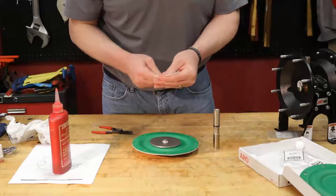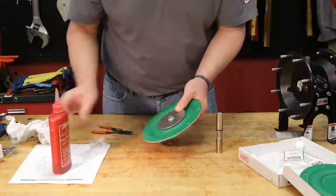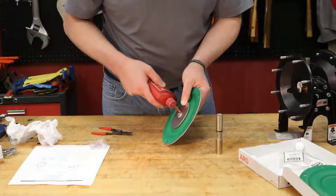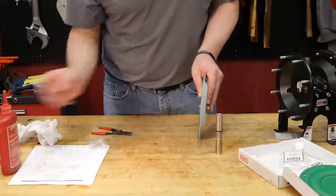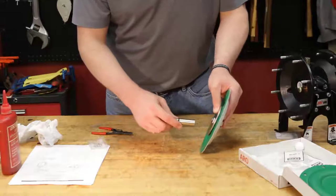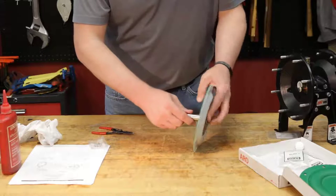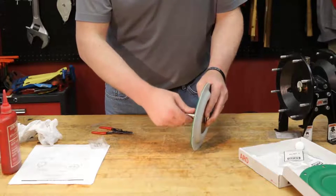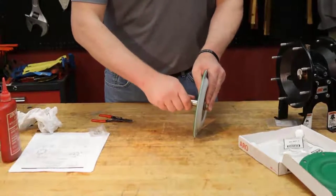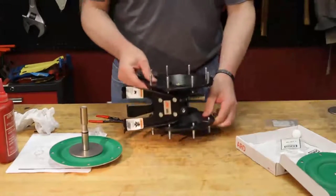And we can put that on in a moment here. Take your diaphragm assembly. Take your 271 per the operator's manual. Get a little bit on there. You don't want to overdo it, but you want to make sure you get enough on there. I use this pump for maintenance classes, so I want to make sure I can get it apart when I use it again. There we go. Thread that on there. Now we get it nice and tight, but we'll torque it after we assemble the other end. Take your center body.